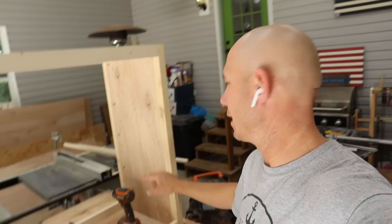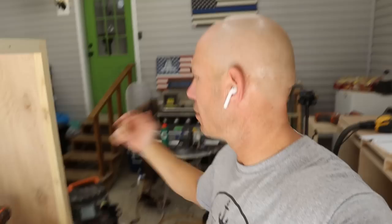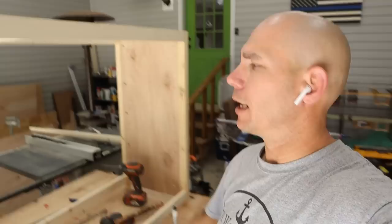There's gonna be 2 of those, so that's 1.5 inches. So I'll take that off. This 31 1/8 inches is what I've got as an opening. So I think it's gonna be about 9 inches and some odd, 5/8, 7/8, something like that when I figure it up. And then we'll divide those into equal parts and put those dividers in there. Remember, cut 2 of everything because you gotta have one on the front side, one on the back. And then there'll be a couple of risers there as well.